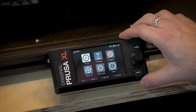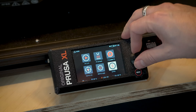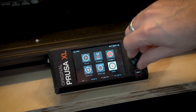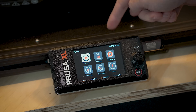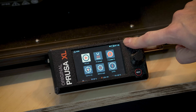This is a good demonstration of why I like the rotary knob and the non-touch screen — I can navigate it a lot faster than a touch interface. It's just easier to select things in my opinion. But anyway, if you switch nozzles, you've got to switch the nozzle diameter for each extruder in the interface as well.